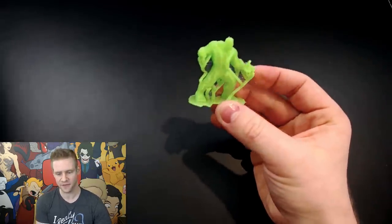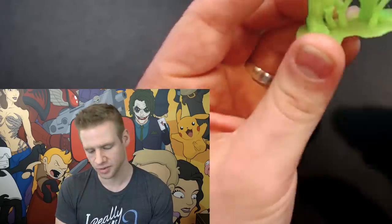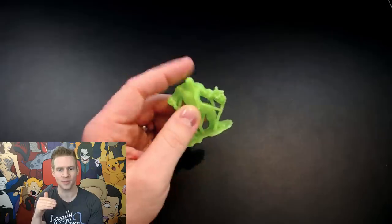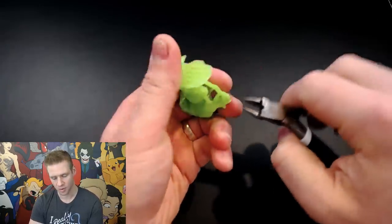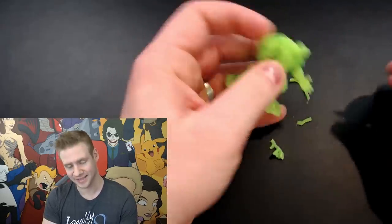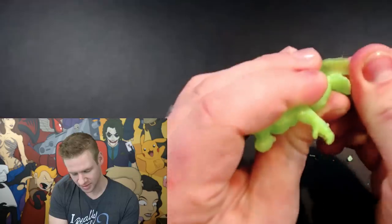Those are usually going to be figures or more humanoid-looking things. So I downloaded this freely available model of the Hulk, and this is my first ever Hulk print — a teeny tiny little Hulk print. This is on default settings at low resolution. You'll see it's got these little weird tree-looking things on it — these are called supports, and they help the printer print from a place where otherwise it would print on midair. I printed what's called a raft, which is what his feet are on, and that too is supposed to just peel away.